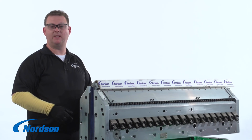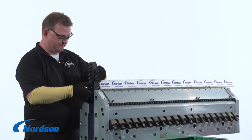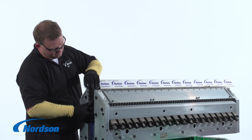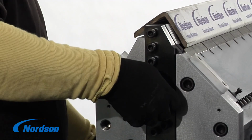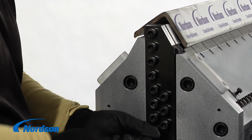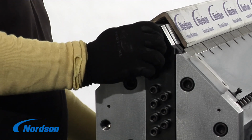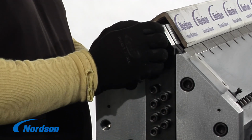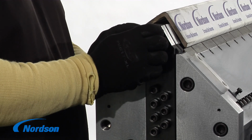Now the end seal plate assembly can be installed with the gaskets. It needs to be flush with the die lip. The bolts need to be snugged up, pushing the seal plate system tight to the die bodies to retain the seals during the heat up procedure of the die.